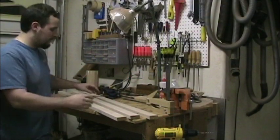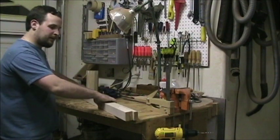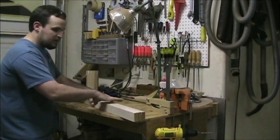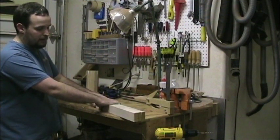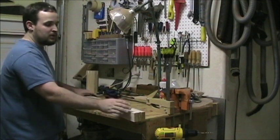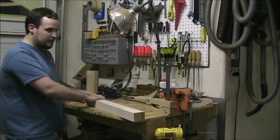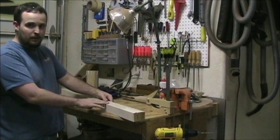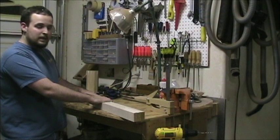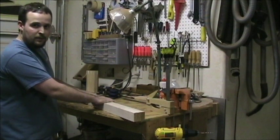The piece has been cut into three on the saw. Now I'm going to stand each one up so the edges are showing on top and bunch them together — this is what I'm going to glue up to be my through-the-body neck blank. This started out as a regular 4/4 piece of curly maple, so in the end I'm just over two and five-sixteenths inches total width, which is just barely wide enough for a bass neck given the taper. I've got about twenty bar clamps and we're going to clamp the living heck out of this.